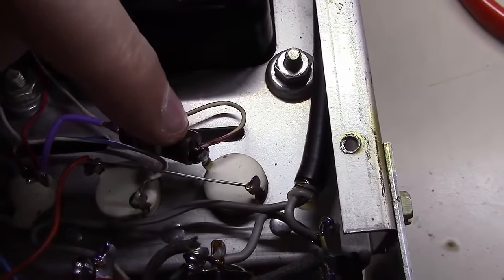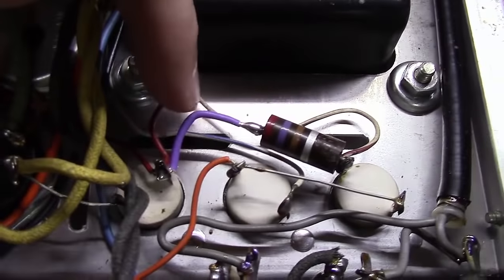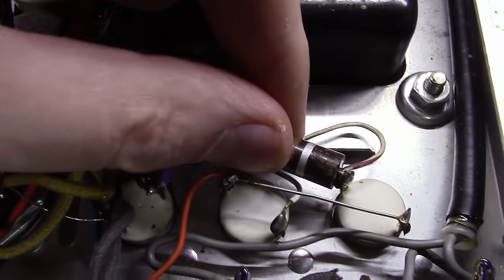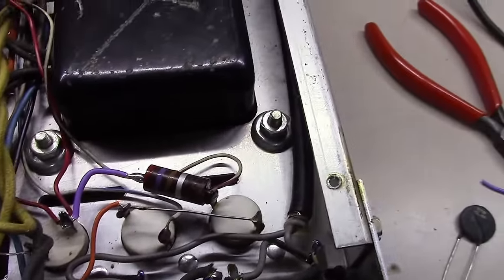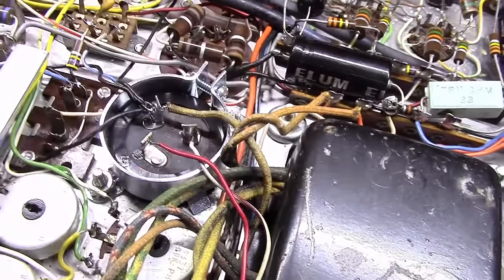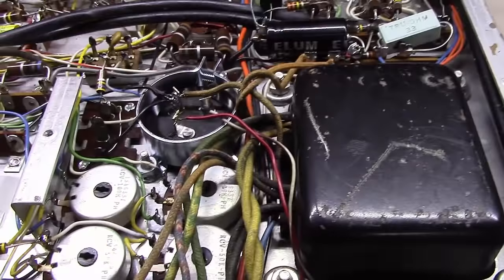And I mounted that 270 ohm resistor up to this post and soldered a little piece of Teflon wire over here to the other side, and that thing is solid as a rock, not going anywhere. We've basically jumped across those same 2 spaces that we've got right here. Just did it down here instead, and it'll work out just fine.